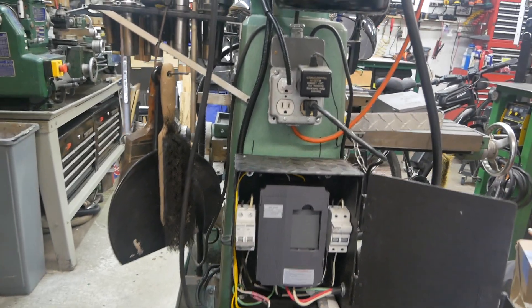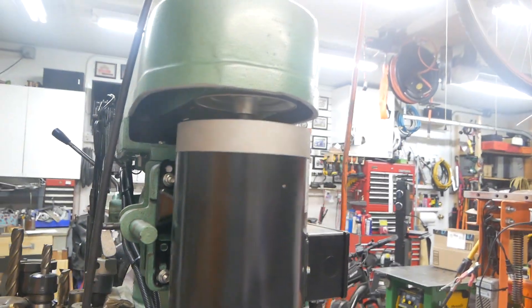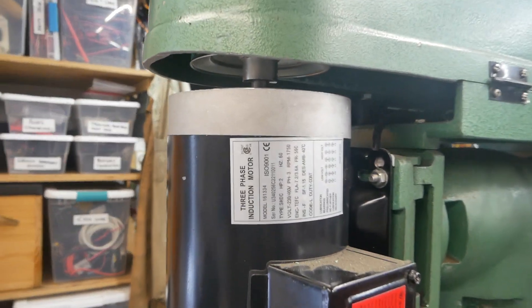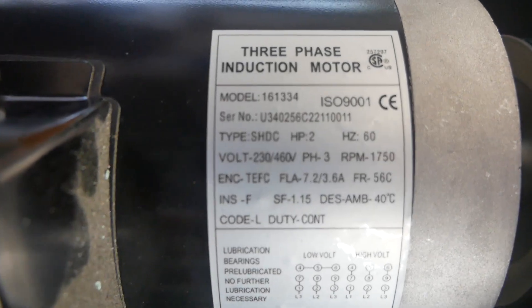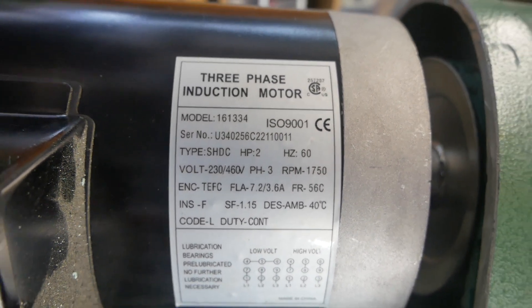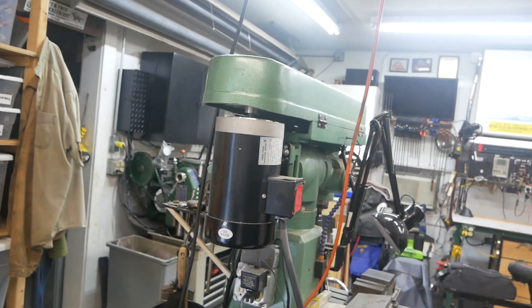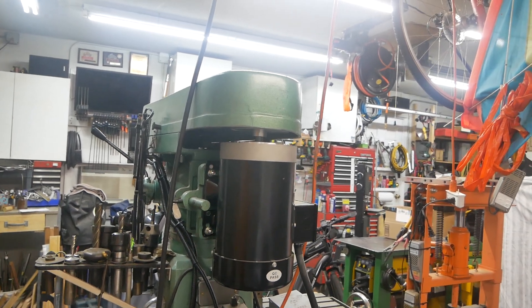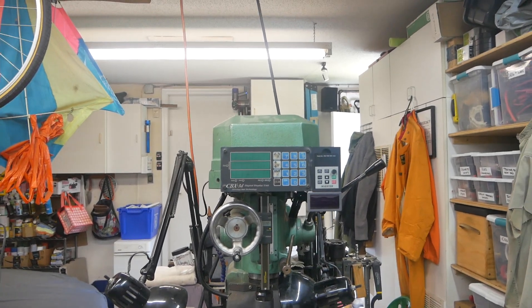More importantly is the power. I've got two horsepower on my milling machine and two horsepower on the lathe — plenty of power. This is the motor I'm using — very inexpensive, $199 on Amazon. I bought one VFD off Amazon and the other two off eBay at the same price. For some reason Amazon isn't stocking this particular VFD anymore — they have similar ones that use the exact same model number but look different. I just wanted to keep it familiar.